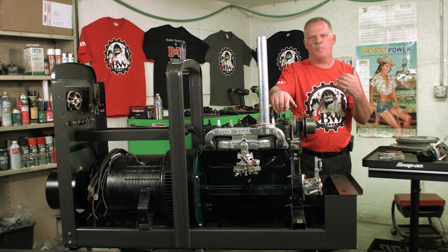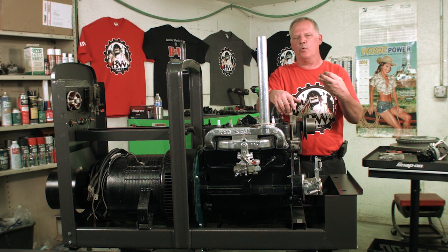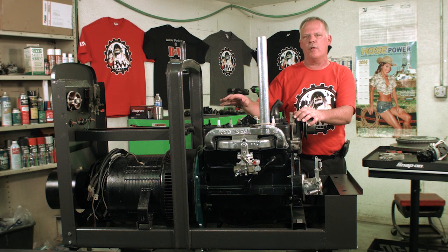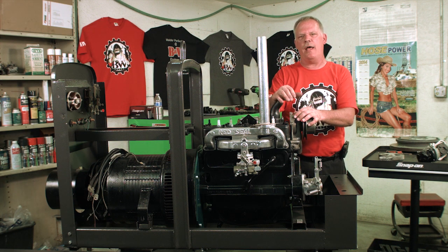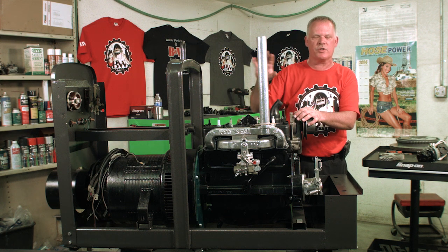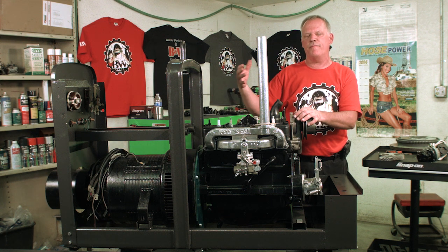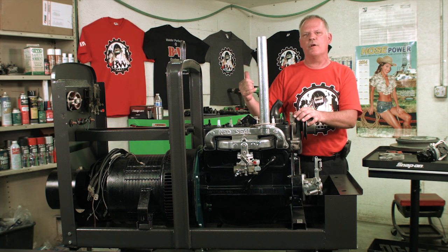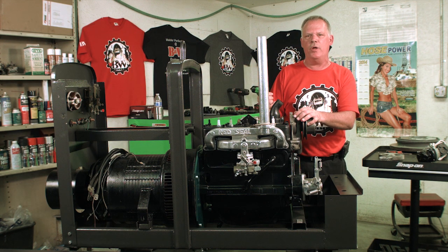Now, the specs for a welder is, the way that it's set up is that the RPM speed at low idle has to be high enough so that it has enough voltage from the exciter armature, exciter brushes, the 2 brushes that are in the back, that when you strike an arc, it has enough current to the stator to kick it to high RPM.